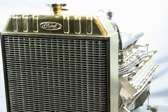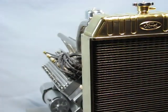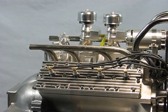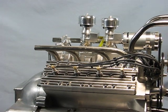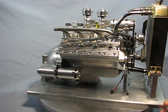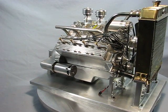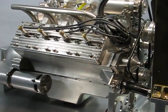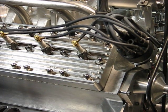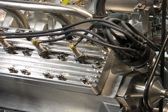The oil pump and distributor are driven off the camshaft with helical gears that I cut in my shop, with a specially designed fixture created by a fellow on one of the forums. The distributor has a magnet and a hall pickup, and sends the signal to a small electronic ignition system that operates on six volts.